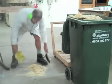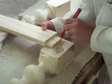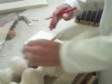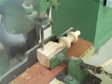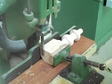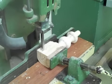People say I don't clean up — well there's evidence. Just marking out the tenons. Make sure your rails are flush with the top of the leg. That's how we check the depth on the mortiser — just check it on the side and then we're away.